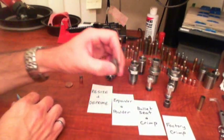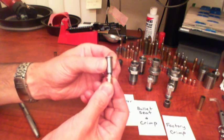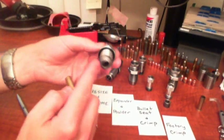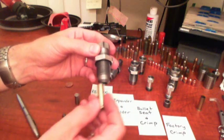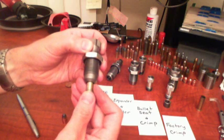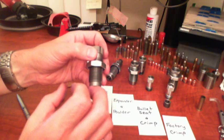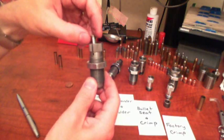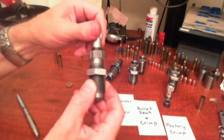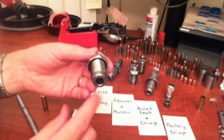That's because the hopper sits on top to feed the gunpowder through the die and into the case. The bullet seat crimp die has a piece of metal that will sit on top of the bullet and push the bullet to the correct depth in the case. The case inside is somewhat tapered and up inside there is a ridge — a bevel — and if you push the case in far enough that bevel will tend to fold in the mouth of the case and crimp into the bullet.